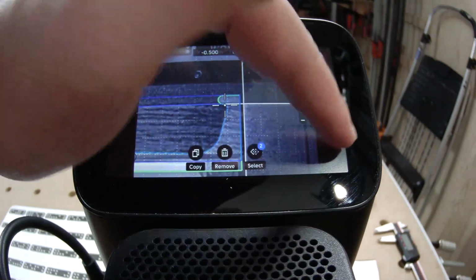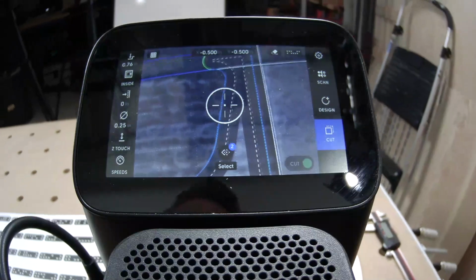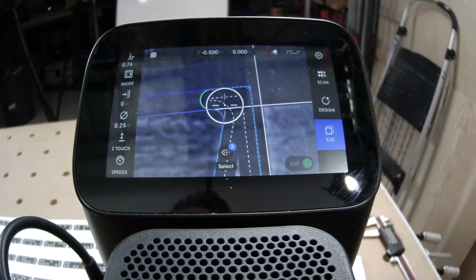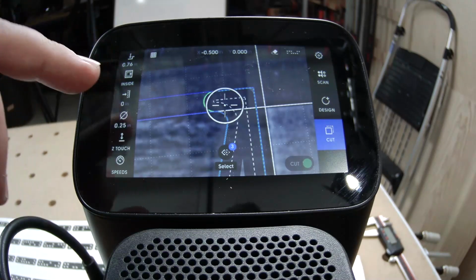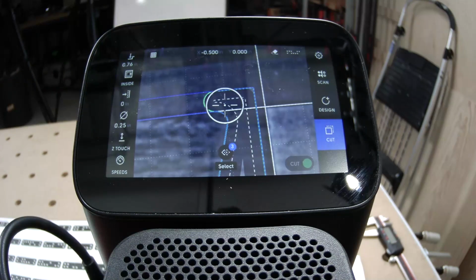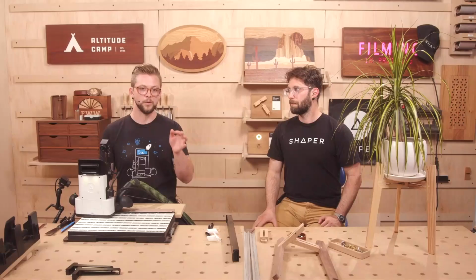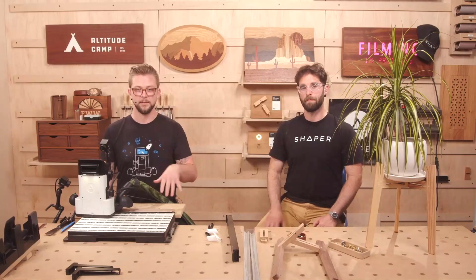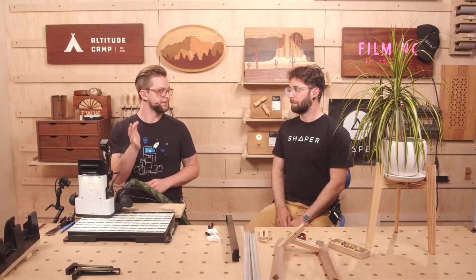One, before I get started, when you're pushing out in the direction like this and you're working against the grain, it's always best to do a little bit of a relief plunge. So before I start this process, I'm going to set my depth to full depth, my offset to 0, and I will plunge right at this kind of precipice point and retract. I'm not even going to move. I'm just going to make that divot to relieve that stress so that if I come around that corner, I'm not going to accidentally tear out.